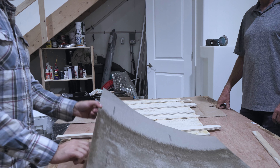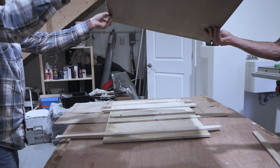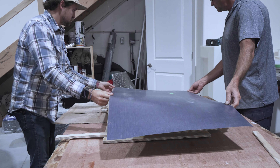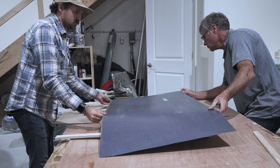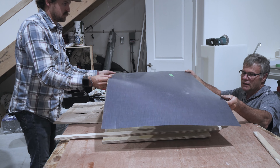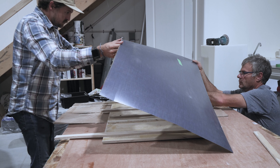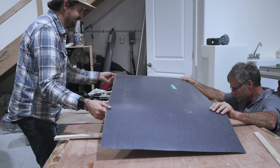You're going to want to wait a few minutes to let the contact cement get close to dry so it's just a little bit tacky to the touch but not gummy and wet. Once it's at that point, it's ready to stick the two together. What I like to do is take slats of plywood — just off cuts from the various cabinets we've been cutting. I lay all the scraps down on the wood piece so when I position the laminate over top, before I do the final stick, I can make sure that my overhangs and everything lines up properly, because once the laminate touches the wood, that contact cement is super sticky and you might not be able to lift it up to reposition.